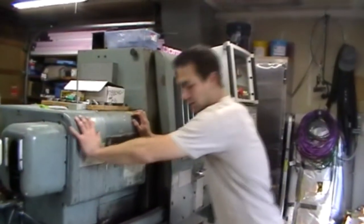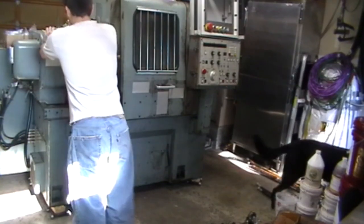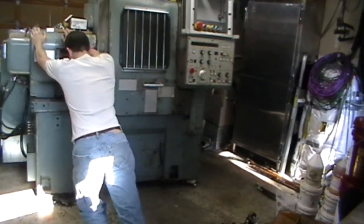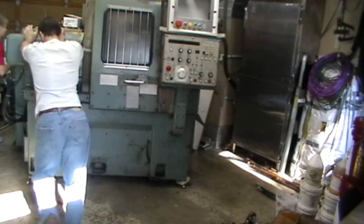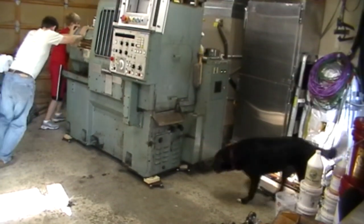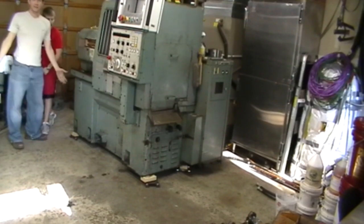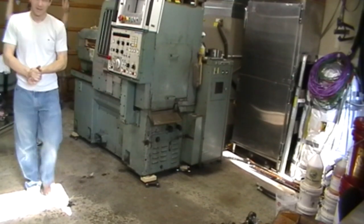The goal is to take this machine and rotate it 90 degrees to free up space in the middle of the garage, but this technique is applicable any time you've got to move a machine. This thing weighs fifty-five hundred pounds and I should be able to move it just by pushing on it. Watch your pause there buddy, that's gonna hurt. Okay, you can pull on here like this — this little panel. Ready? One, two, three.